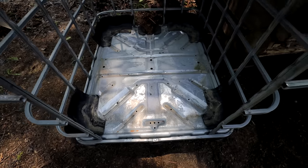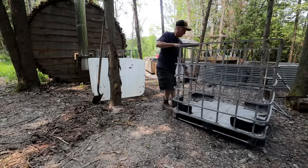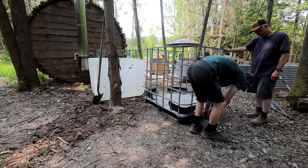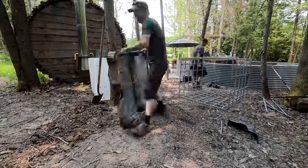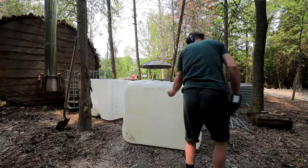To cut the top of the bin we used a cordless angle grinder with an abrasive disc. We cut the bottom piece at the flattest part of the IBC tote so the top clamshell sits on the inside to retain all the water once it's put together. I cut my door opening at the closest upright that would give me enough space to walk in and walk out — because this thing is going to be luxurious when it's done. I polished the cut edge so you don't get any sharp barbs. This little chunk will allow us to put a door jam to hang a door on it. It's nice and spacious — you could even sit down in your shower. Lots of room for activities.